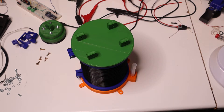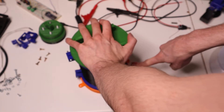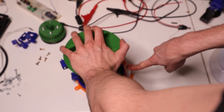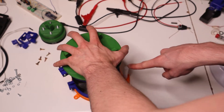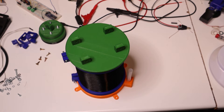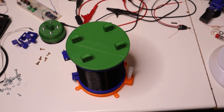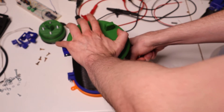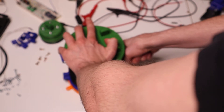You can also test this in reverse — I'm going to seal it up again with my finger and push down on this thing. You can hear that something is leaking out and I can definitely get this bellows down. But I'm pushing with a little bit over 10 kilograms of force, which is creating a pressure in here of over 100 centimeters of water — way above what a patient should ever experience. Even at that very elevated pressure, the leakage is actually very, very minor, especially when we compare it to just how terrible that piston was.